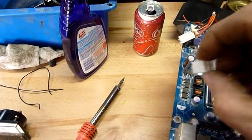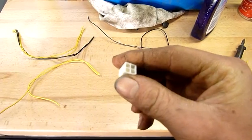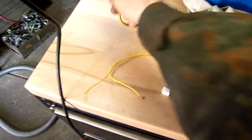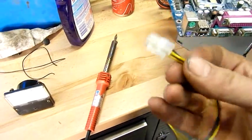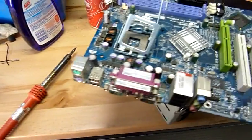As you can see, I've taken the connector off this dead main board, which is similar — they all have the same pin configuration as far as I've seen, although you'd always verify it. And the power connector off just a crappy old used power supply, and I'm going to be combining them with the amp meter, a couple of ring terminals, and that should do it.